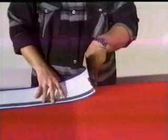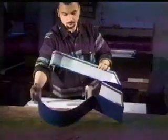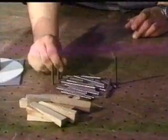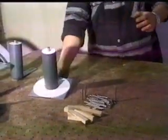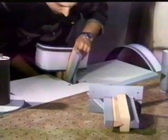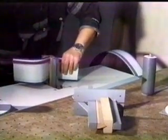We would like to introduce you to one of the easiest ways to produce block letters using Alurapid aluminum band. The method is simple, efficient, and inexpensive. We use the following tools: an assembly table with a set of jibes and cotters, a set of rollers for producing curves, hand or pneumatic presses for bending the material, and other simple workshop tools.